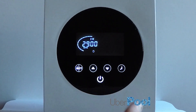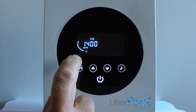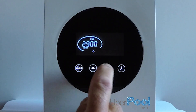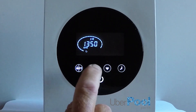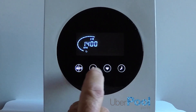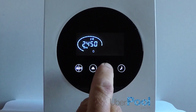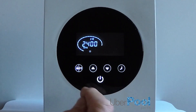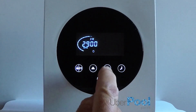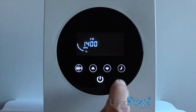You can operate the unit by timer or by mode. Pressing the mode button on the left will change the mode speed: low, medium, high. Now it is on high speed at 2900. This can be reduced by using the down arrow buttons or you can jump through each mode. In this case, we will reduce it down to 2400 RPM to run the suction cleaner. You can use whatever mode you like — low, medium, or high — and the speed is adjustable for each of those modes.